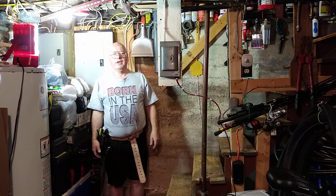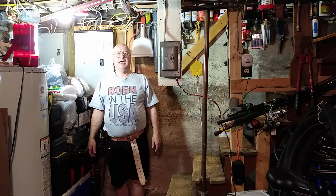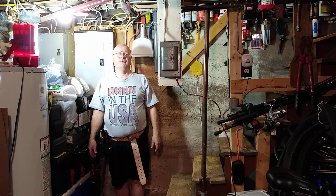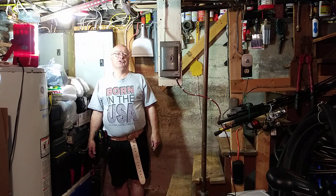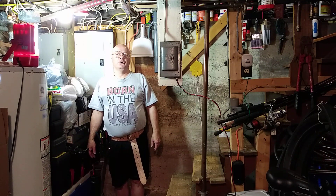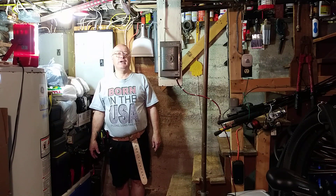That is how to wire a switch that is after the light. Here we use 120 volts, 60 cycles AC. One thing you want to do when you hook that switch up after the light is remark the white wire with some black tape or some red tape.